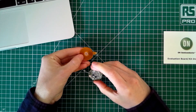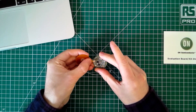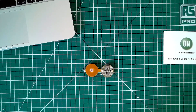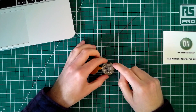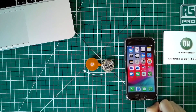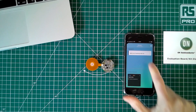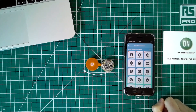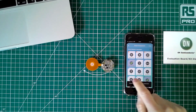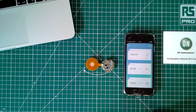We can now insert the NFC antenna, taking care to ensure the On Semiconductor logo is facing up. Now the next step is to get the device connected to the mobile app. Reset the device and open the RSL10 Sense app, which we've downloaded from the Apple Store — we also have a version available for Android. On this screen we select which sensors we want to display, pick a few here, click Save, and now we should start seeing some data coming in from the device.